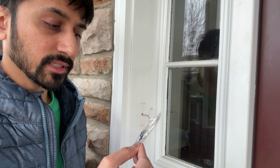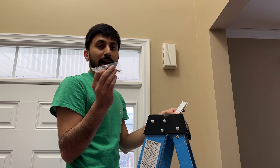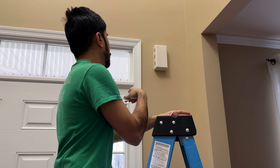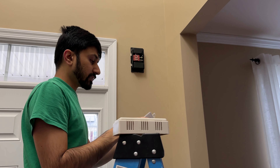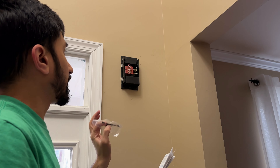It is very important to use this jumper cable. The jumper cable bypasses your existing doorbell chime and must be installed before you install your Ring doorbell. Your chime cover might have a screw, but most of the time it just pops right off. Then, if you look at the instructions, it will say you loosen the terminals and connect two of the terminals.